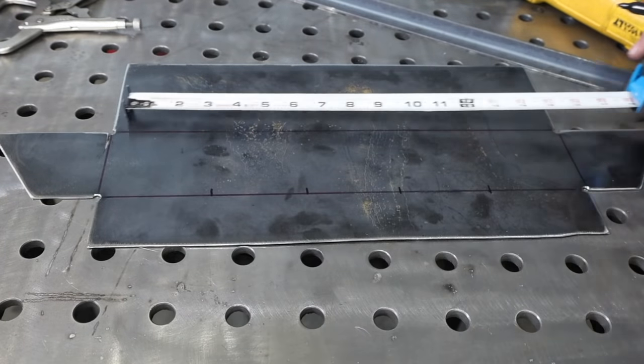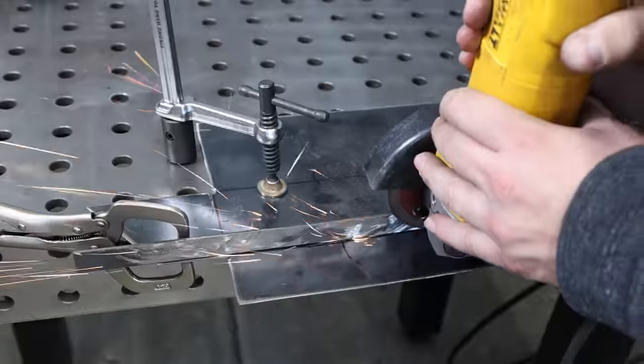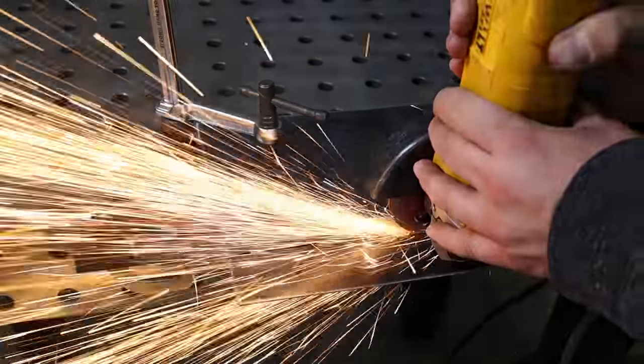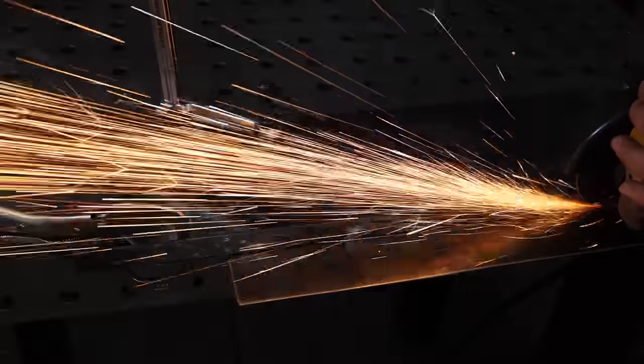Now I've created this flat pattern and I need to bend it. In a sheet metal shop this would be done with a brake, but if you want to do it without a brake and you don't need full strength in that joint, you can use a trick I often use when designing parts for laser or plasma cutting — make little slots in it periodically throughout. I'm going to mark out some evenly spaced areas and then use this grinder to plunge down through. That's going to create a slot and weaken the material in that area so I can make the bend much easier.